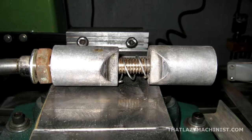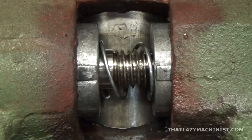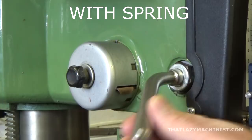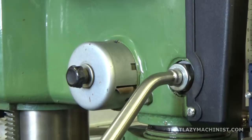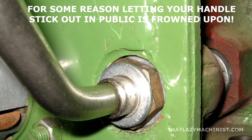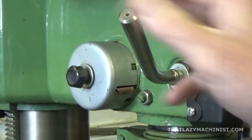The spring does two things here. First, it maintains an outward pressure on the two half locks of the spindle. This permits a lot more control because when I loosen off the locking handle the two halves separate from the spindle quickly. The spring also maintains a certain pressure on the handle, stopping the handle from turning automatically to its lowest point as soon as the spindle is unlocked — you could say the spring helps keep it up. The spacers are there to position the handle properly so that it locks in a forward position, comfortable to work with.